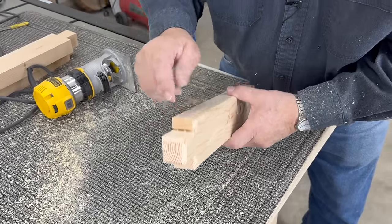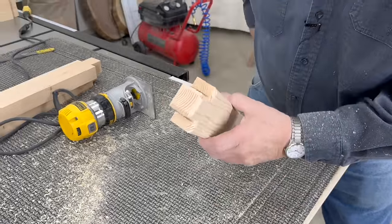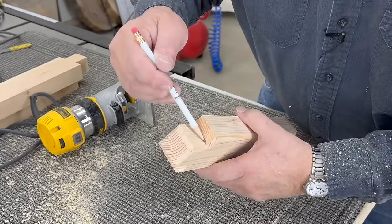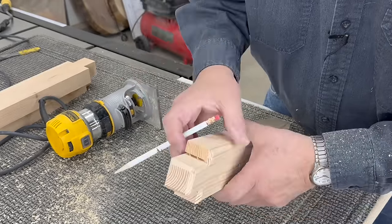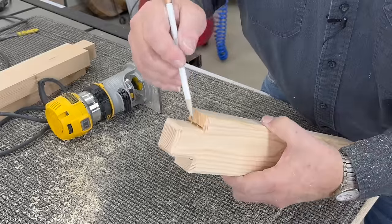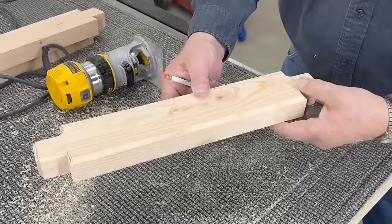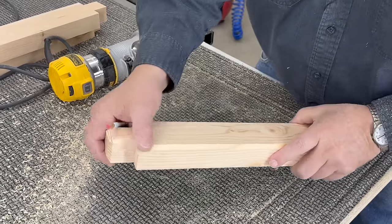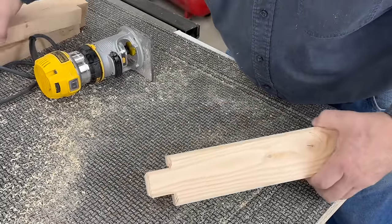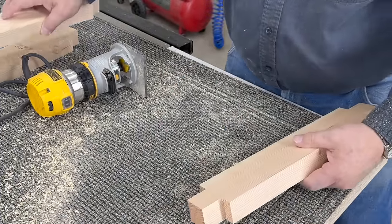Remember I told you one of the reasons we didn't want to cut all the way to the line on our side cuts — well here's the reason. By putting our chamfer here, if we had cut all the way to the line we would have a hole right where our saw blade had gone all the way forward. By keeping our saw blade away from our line, we don't have a problem there — we have a nice clean corner. This is going to be an outside piece, and this is as close to finish as we can get. Let me route another one and I'll show you what it looks like when it comes together.